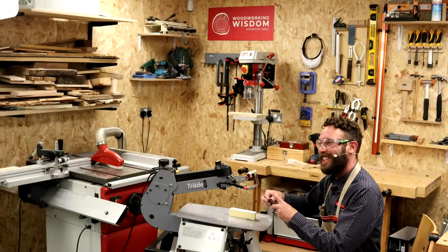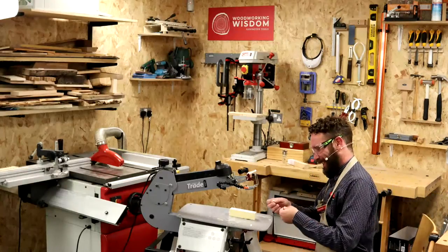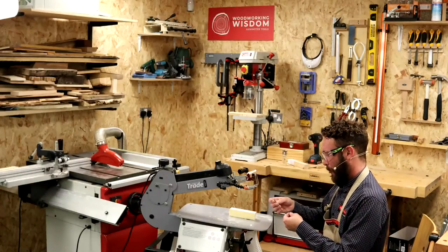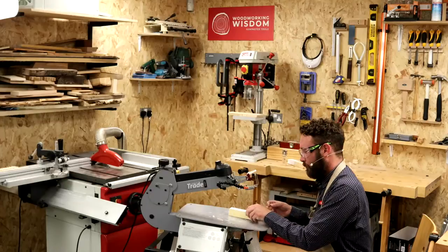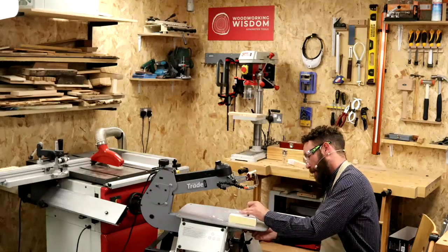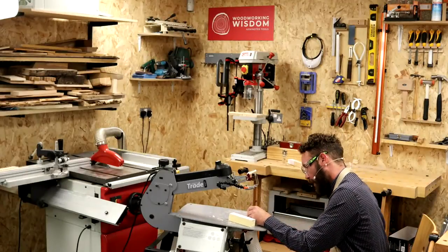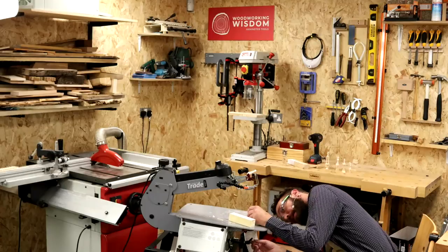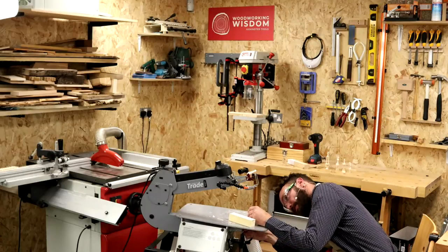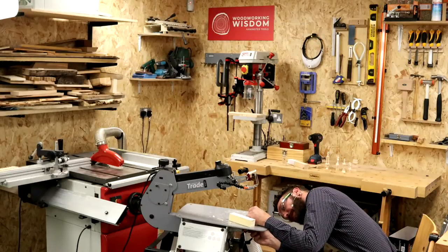Got a well-timed question. While you're doing that, Ben, I was just going to ask one. Woodwork Learner again: what blade would you use if you were going to cut some harder timber, something like beech? The beech. So I would never go this thick with a piece of beech. If you're cutting something a bit thinner maybe, I always favour those modified geometry blades. They're really nice cutting.